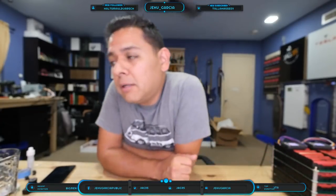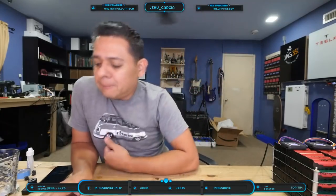This is half of those super cheap cells that Tom sells. There's a lot of them. Over about 50 cells out of 200, which is what, a quarter? It's a lot of cells that were completely dead, and I haven't been able to wake them up. So that's quite a bit of bad cells from the get-go, right? And the other ones are all coming out around 2,000 milliamp hours, and they're originally 2,200, so they're not too bad. A couple of 113, 115, but the other half of the cells is still in the chargers. They're still processing there.